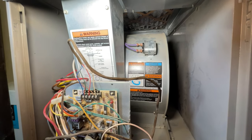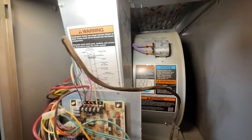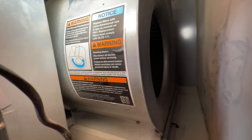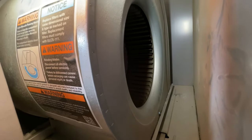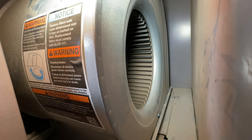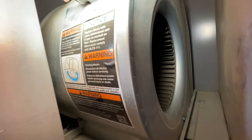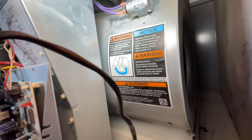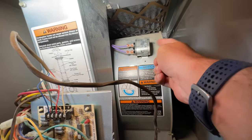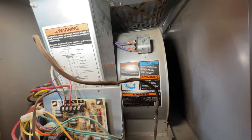The capacitor can fail on your blower motor, which causes no airflow through your vents and that whining sound at your furnace or central air system. Now, if you have the power off, you can use a screwdriver or a piece of wood and try to spin what's called the squirrel cage — those are the blades for the blower motor. If that spins freely and doesn't seem to have any restriction, hopefully your motor is still good, and that leads us back again to this capacitor. Let's remove it and I'll show you how to test it to see if it's bad.